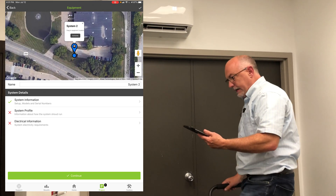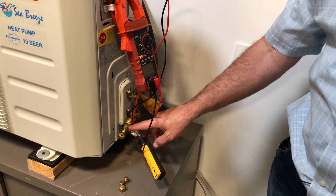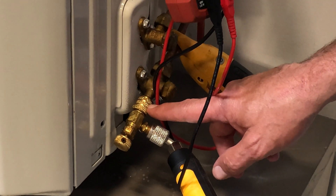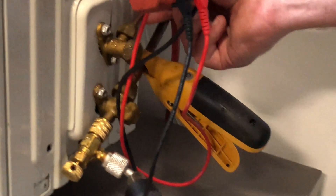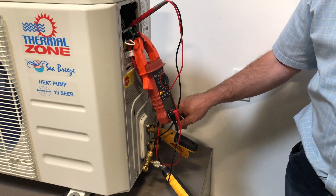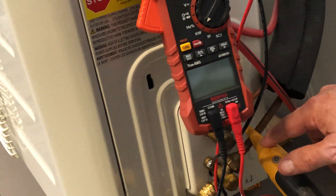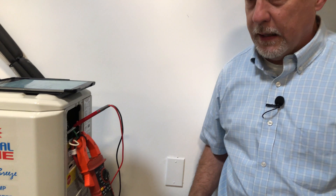Get all your information inside first, then get the rest outside. One thing to remember on a mini split — we have a low pressure probe. You can get a 5/16ths core depressor connector from AccuTools. It's only a few bucks and has three bands indicating 5/16ths. When you drive it in, it depresses the Schrader so you can read pressure. We've got a suction line clamp on the larger line. The small line is not a liquid line on a mini split — it's a saturated liquid line, so it's cold piping going out and cold piping coming back. The metering device is inside the bottom of the condensing unit, so you'll only have a suction line. Don't worry about measuring the small line. There are no prescribed temperatures for these lines. I'm measuring suction line temperature, suction pressure, outdoor air, and voltage on the incoming power.